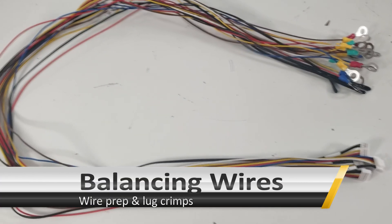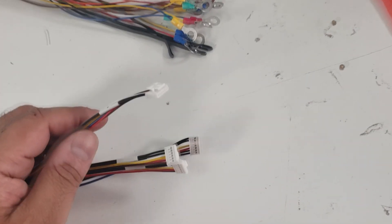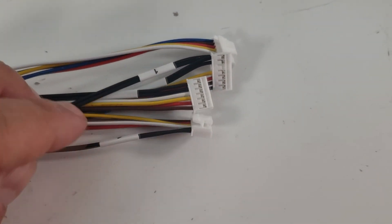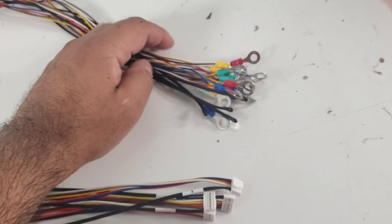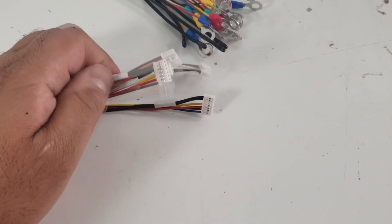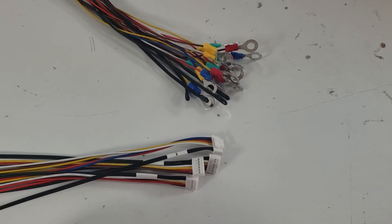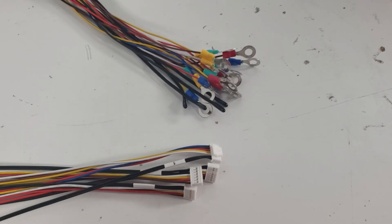One of the first things you're going to encounter is that it comes with quite a bit of balancing wires, actually divided into four subsets. If you look closely, you're going to have things labeled one, two, three, and four — four sets of balancing wires, which makes it a little easier to install. You're going to want to install your mounting lugs. I like to use a different color lug for each set — green for ones, red for twos, and so on. You will need to strip and double or triple up the wire to get a good crimp, as the wire is pretty thin — about 24 gauge.